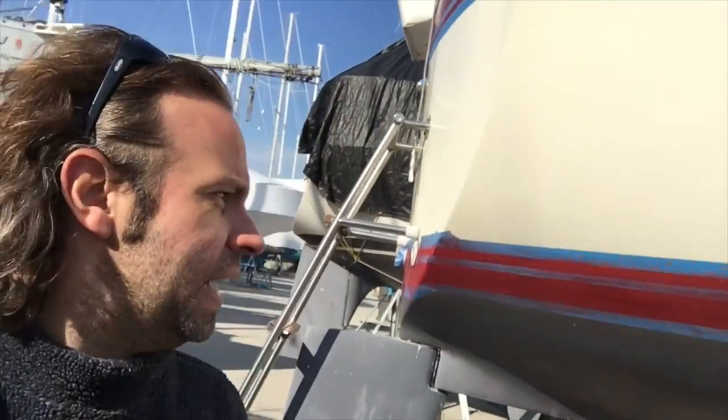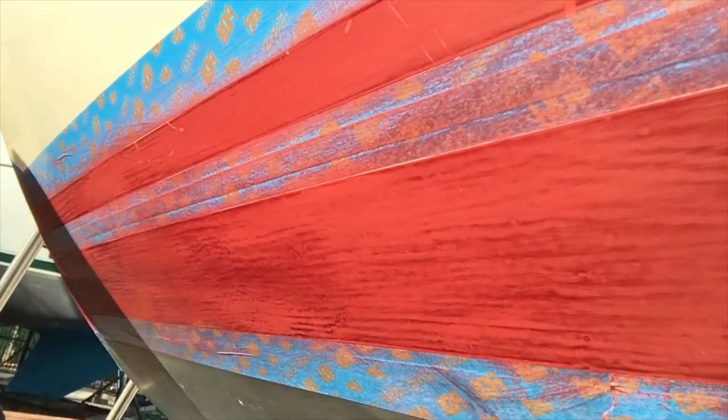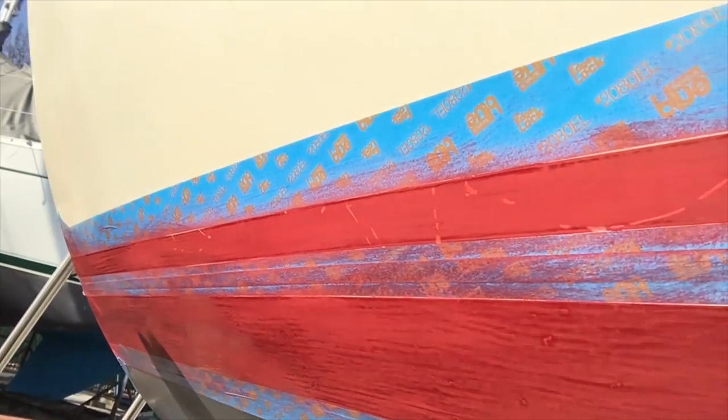Tape's off, she's been sanded. It's kind of important to know why you sand something because that dictates how you sand it. All we're trying to do is give a key to the existing stripe, because it was painted with the same product we're using today. What we wanted to do was make sure that it was keyed so that the paint would bond. It's a one-part epoxy paint, and that requires a mechanical bond, so it needs to have that key. So now we're ready for a little bit of paint.